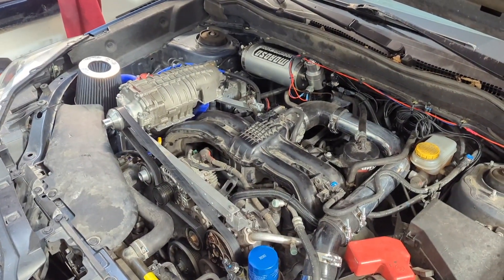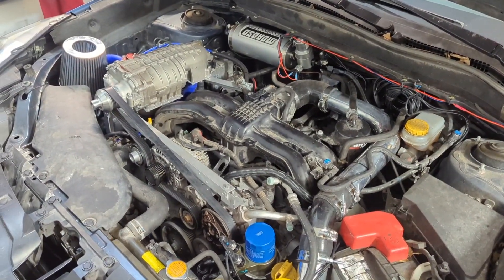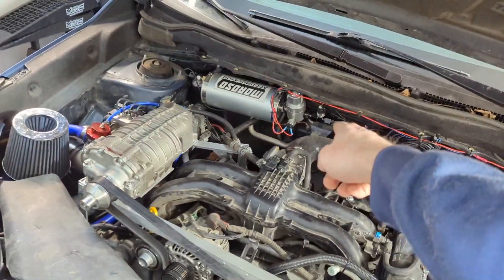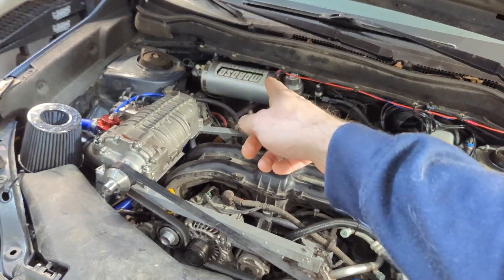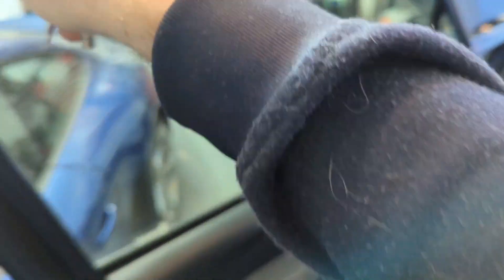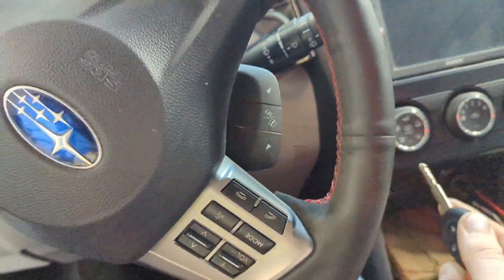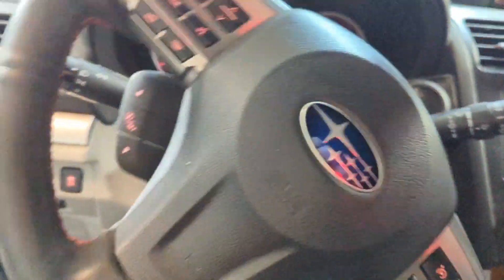What I'm going to do is floor the accelerator pedal and crank — that should prevent fuel from being injected. I'm going to do that until I start to see oil pressure at these sensors, and also importantly that sensor. I don't know if simply cranking will build enough pressure to begin filling the AccuSump; I just want to see any amount of oil reach the entrance to it. I'm going to do it in a closed garage since we're not really trying to start the engine.